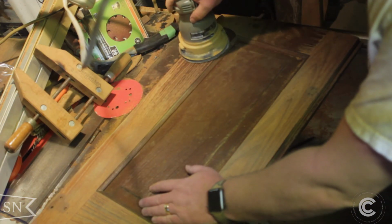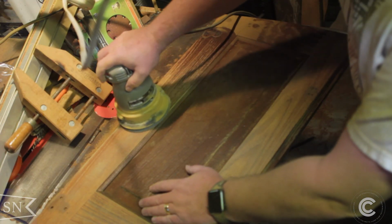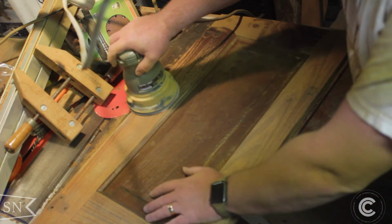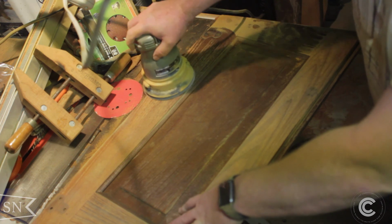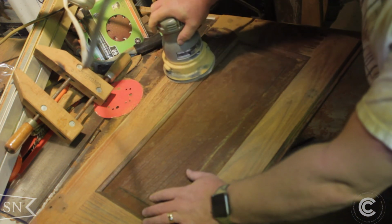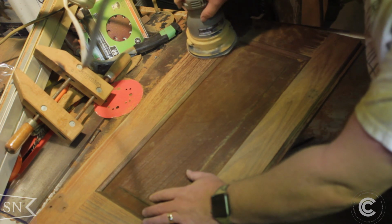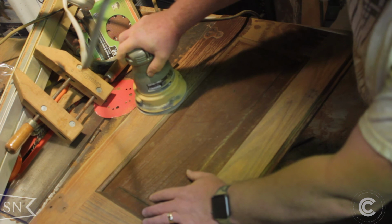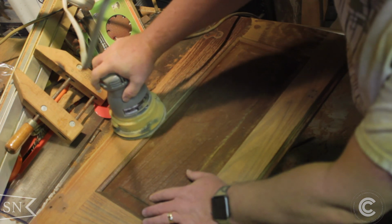And I started working on the companionway doors. These are pretty tricky because, again, they're weathered very much on the outside, but they have the raised panels on the inside, which makes it very difficult. I started off by using a heat gun and a sharp chisel to take out the finish in the raised panel area, and then a lot of hand sanding with a small flexible foam sanding block. They are just about ready for a finish to be applied to them.